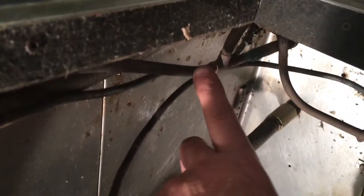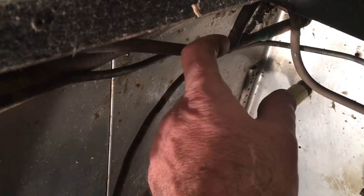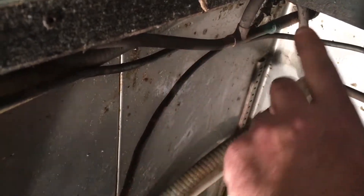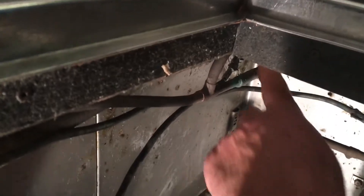The correct way to do it: run a half-inch main line, put half-inch tees in, and then drop your three-eighths lines off those tees into each evaporator. You dump your three-eighths into a half-inch tee so you stay on a half-inch main line all the way down. That way you can get your heat out.